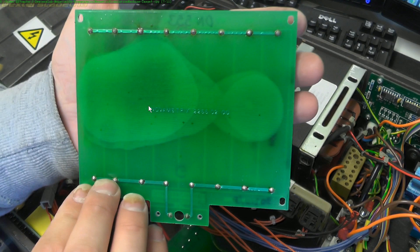These power resistors are usually five or ten percent tolerance anyway, so it could have just been bad luck that these ones happened to be lower value than the other ones, and handled the grunt of the power dissipation there. You can see the laminate around here — the central spot where the main power's been dissipated — but then there's a radial pattern around that, and that's probably delamination caused by the heat spreading out. They don't call these FR4 laminate for nothing.